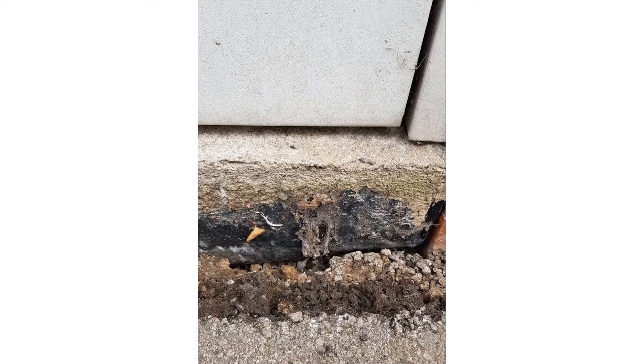Here you can see the garage slab itself — it's a floating slab, not actually connected to anything. It was approximately six inches thick and you can see it's been protected from water coming through with a plastic sheet on the underside. My initial thoughts were I could build directly on top of this floating slab, since the wall going on here wouldn't be that heavy and all it's supporting is the weight of the window itself. However the building regulations people didn't like that idea.